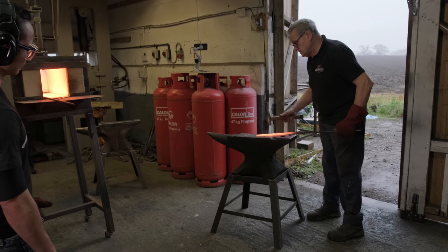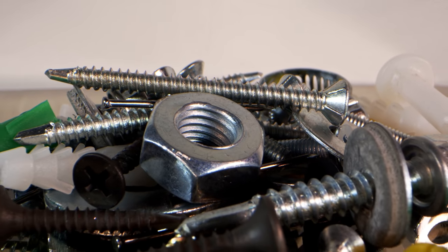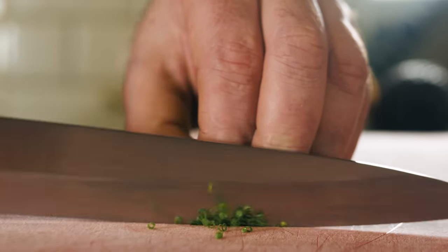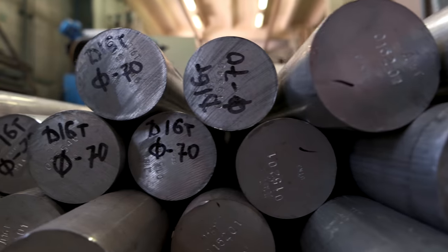Your stainless steel knife is pretty good. I've made stainless steel knives; I've got some I made 15 years ago that aren't showing any signs of corrosion and they get used every day in our kitchen. The stainless steel knife has chromium in it - the theoretical figure is about 11.8 percent chrome, but it's got to be 12 to 13 percent minimum really to become stainless. That chromium forms chrome oxide on the surface of the knife blade. Chrome reacts with oxygen at room temperature to make chrome oxide instantaneously - it's only a layer that's microns or possibly sub-micron thick, but it's completely impervious to further oxygen, so more oxygen can't get down to react with the iron underneath and make it go rusty.